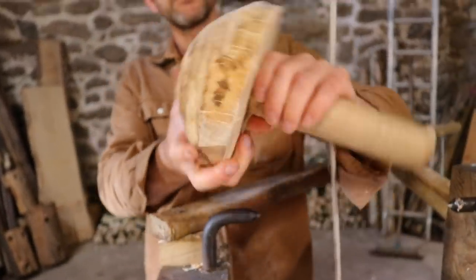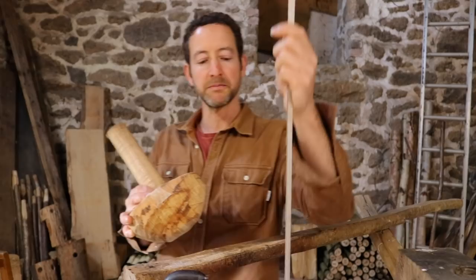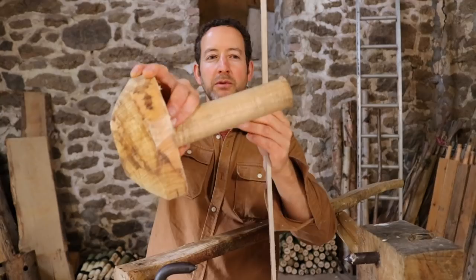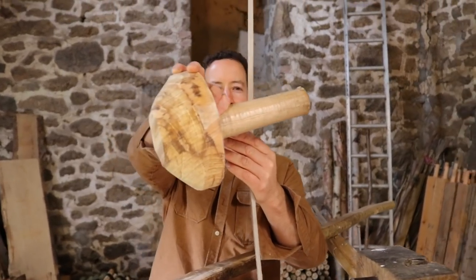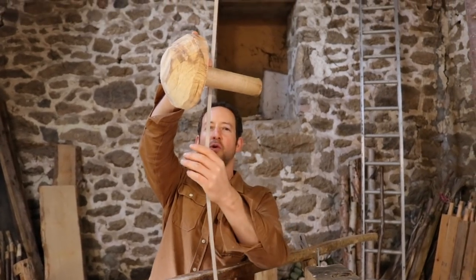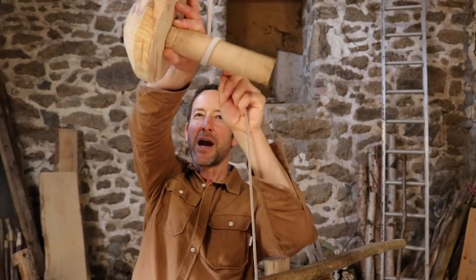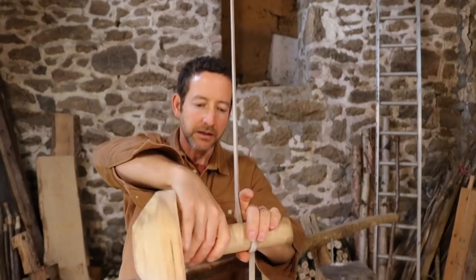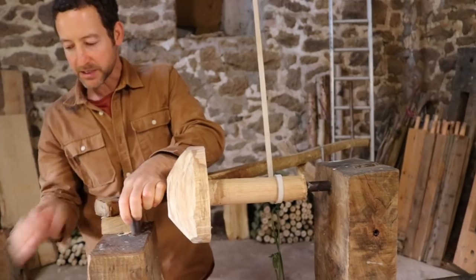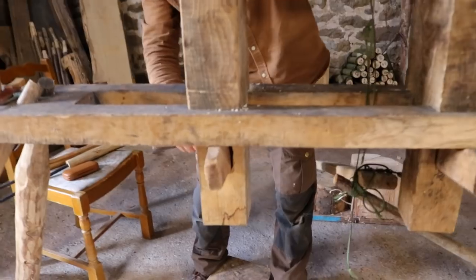So from that point, I'm now going to attach the cord, which powers the whole thing. And I do that by putting the mandrel behind the cord from where I'm standing. So the cord is between me and the mandrel. I then wrap the cord around by pushing it to my left-hand side and around. And then roll that down, place it between the centres again, give it a tap, and then I'm hitting this wedge home down here.